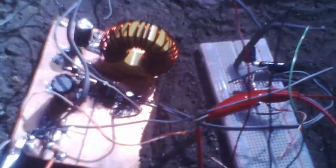There was a problem with the ACS713 I put on the buck converter board — it was dead and wasn't doing anything. So I replaced it with a known-good ACS713 on an evaluation board I built, and now it works.